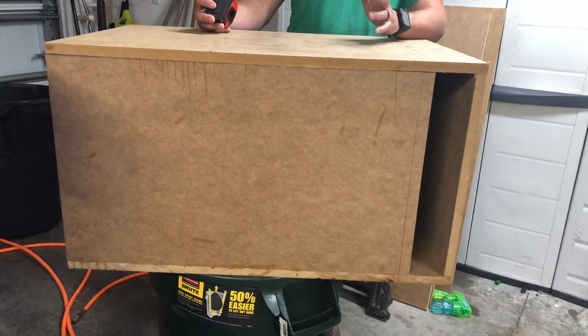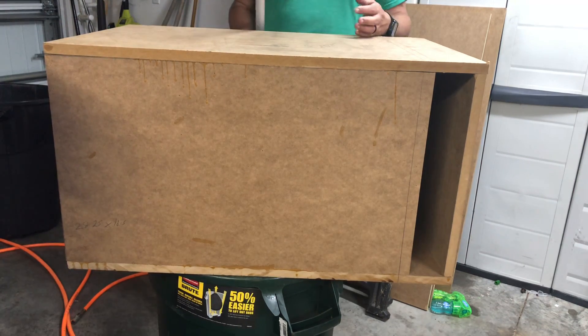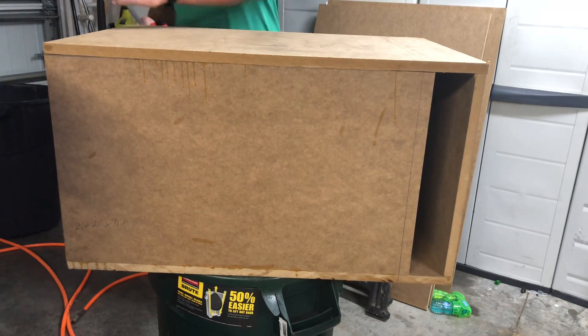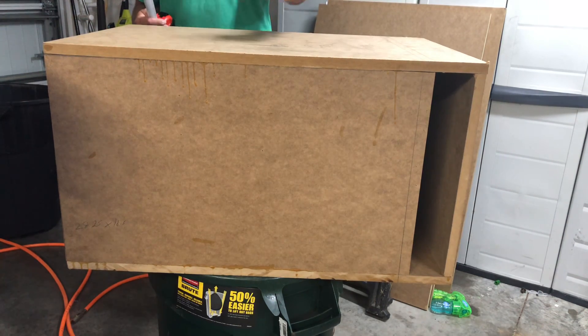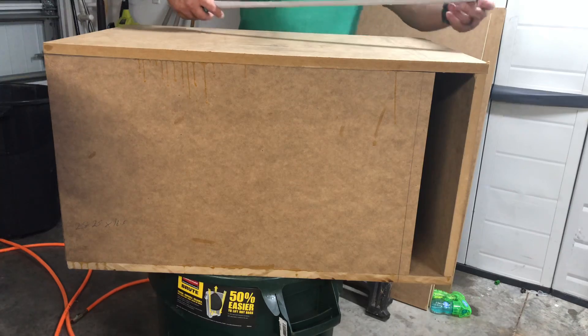This box should be tuned anywhere from 32 to 34 Hz depending on factors. These are outside dimensions and port dimensions only — internally it will change with more bracing. If you put poles or cross sections it will change your airflow a little. For corner bracing you can do 45s or 90s; I've seen people do squares on the sides too. If you're doing two subs, put a pole or a square beam. This is a slot-ported box and can be oriented right side or left side depending on which way you want to mount the subs.